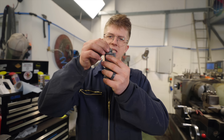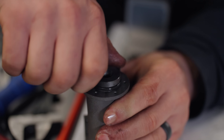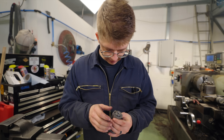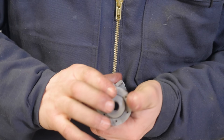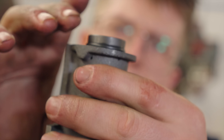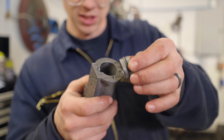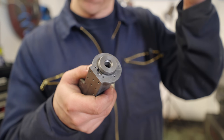I don't know how this is meant to fit in there with an O-ring on. I've got it made to size, but that's obviously not going to fit — there's an O-ring in the way that's too large. There's absolutely no way that's going to go. That O-ring is so proud of the hole. I'm going to need to ask your help and advice, guys. What do I do with this piece? I've made this to size and the O-ring does not allow it to drop in. Do you force it? Does the part need to be modified? If you actually know, please let me know down below.